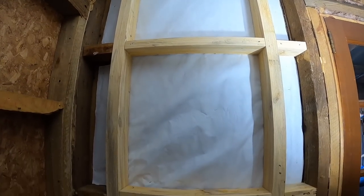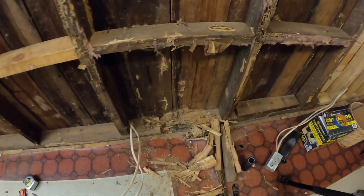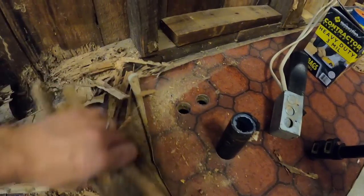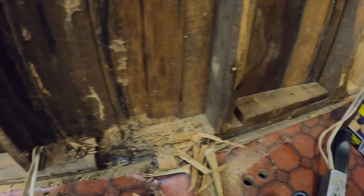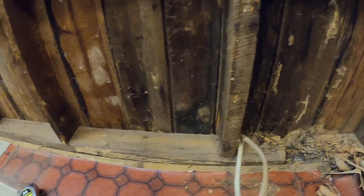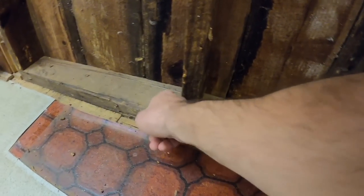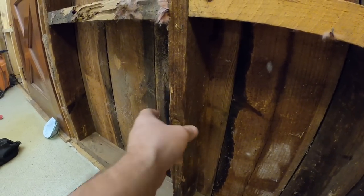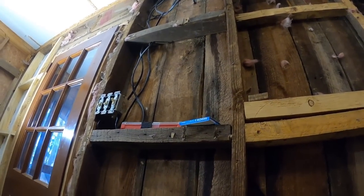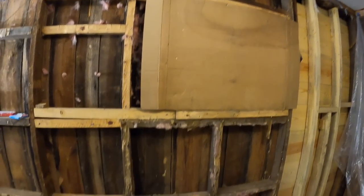This little section of the wall is complete and ready for some insulation, so we're going to move on over here. I've been digging at it just a little bit and we've got some pretty serious damage on this bottom plate. The subfloor is still looking great, thankfully. Right here is where one of the sinks used to be, so undoubtedly this was a moist place and the termites set up shop right in here — that bottom plate is wrecked. I'm going to cut out the bottom plate to about right here and replace it; from here to the left is still pretty solid. This stud has very minimal damage, not enough to warrant ripping it out, but that one has to go. These other two are okay. And we're going to start on this wall right here — this is going to be a brand new framed-up window, and I think it's going to look really nice.